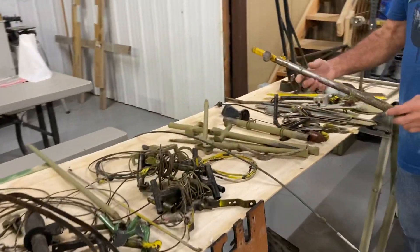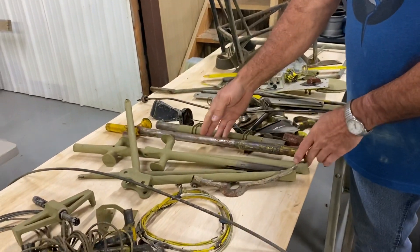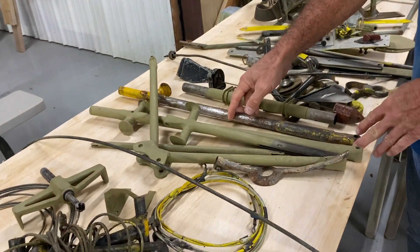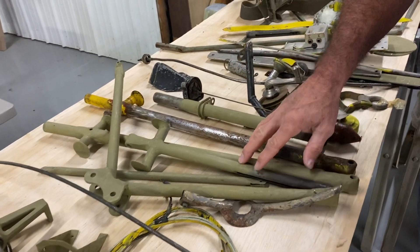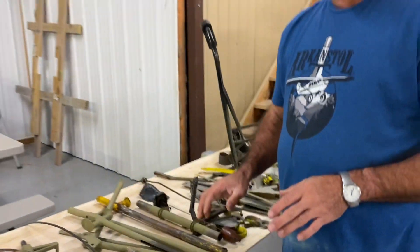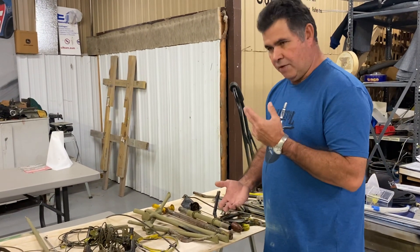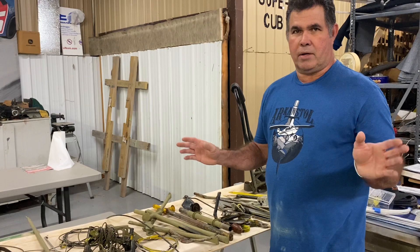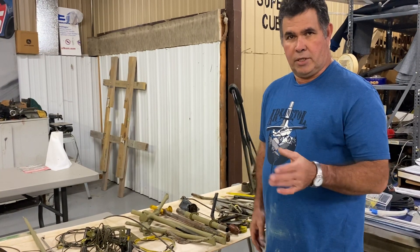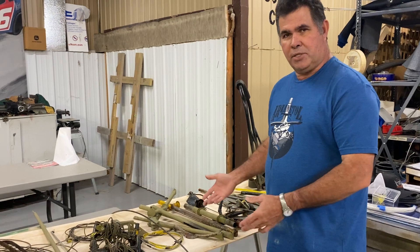It's a time to look at your old struts. On this particular one I will probably not rebuild these, because I hope by the time I'm to that point, talking with Acme Aero, their shocks are going to be STC'd for the J3 also. So after flying their product on several planes, unless it was going to be a period correct J3 — and this one's not — it's going to be legal, I'm going with the Acme shocks on it.